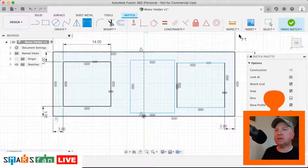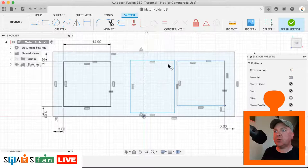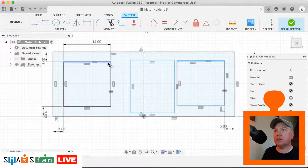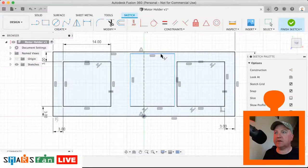and it still thinks that there, it's still got some blue lines there, so why is that? So it's the up and down. So what we can do there is just do a collinear constraint on the top line. So do that edge to that edge, collinear that edge to that edge there, and then that edge to that edge there. Perfect.